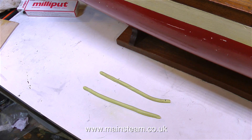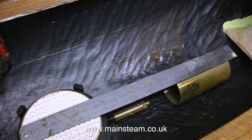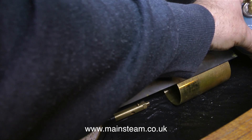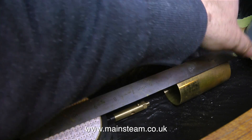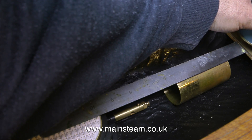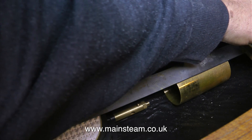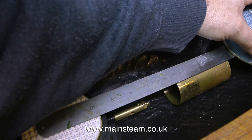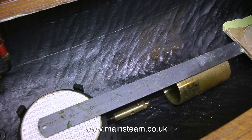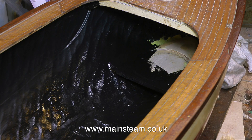Here are the two pieces of Milliput ready to fit to the shelf — you can clearly see the Milliput applied to the shelf in the right-hand side of the picture. While that's curing, I'm looking at the layout of the condenser oil trap. This is just a short piece of brass tube — not the finished condenser — I'm just using it with a ruler to make sure there's plenty of room to insert and remove the gas tank without it fouling the condenser. I've figured out I can use a piece of 2-inch diameter brass tube, 5 inches long, for the condenser.